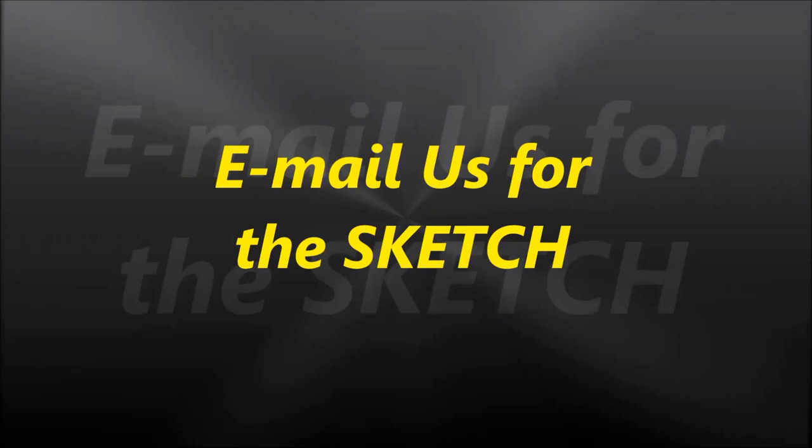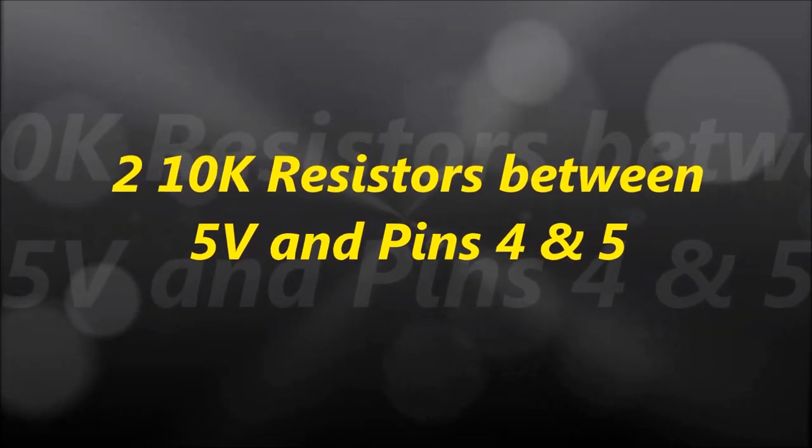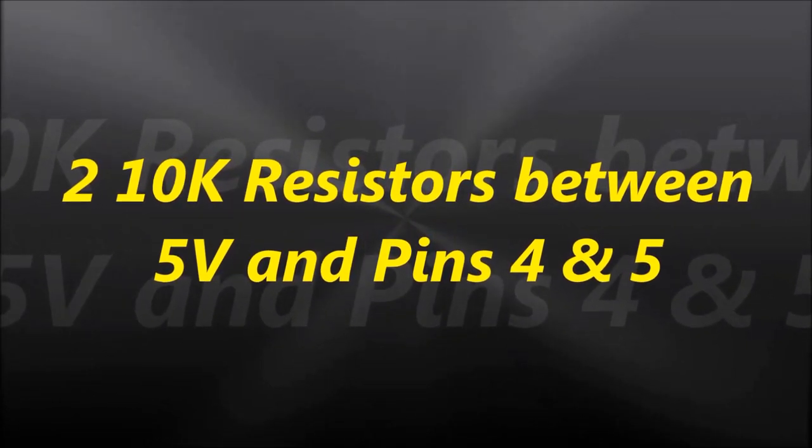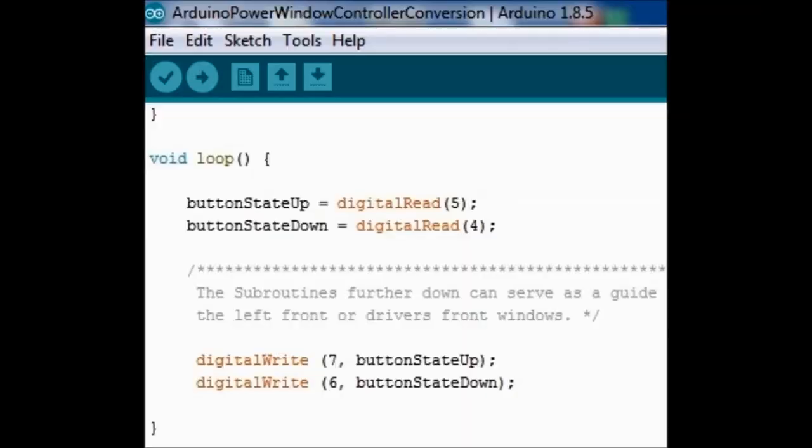But having said that, the sketch tells you how to connect the two 10K resistors that you have to connect on these buttons. They have to be connected to 5 volts. Everything you see is there on the sketch, but it's very simple, a very straightforward connection. Next, we're going to go into the loop side of the sketch, and this is standard in any Arduino sketch. As you can see here, this is pretty straightforward. You have two variables: button state up and button state down.